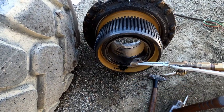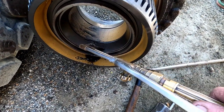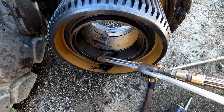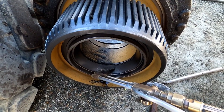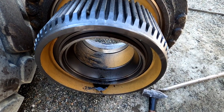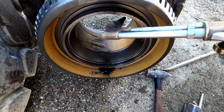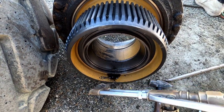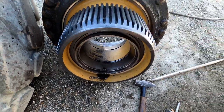These races here — what I'm going to do is heat them up. I'm going to heat a red stripe right across here, just let them sit. When that part gets cherry hot, the molecules expand and because it's already pressed in, it compresses the molecules. When it shrinks, the molecules are actually more compressed, so it draws back in and this race will just fall right out — it makes it smaller on the outer diameter. There's one on the other side too, so I'll do both.